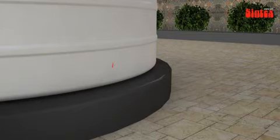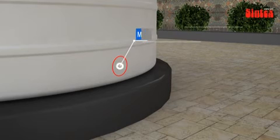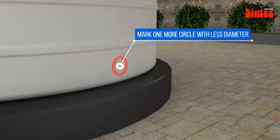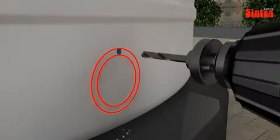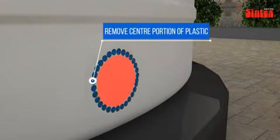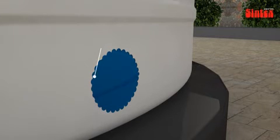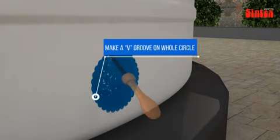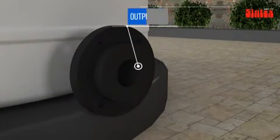For holes with 2 inches and more, determine the size of the hole to be made in the tank. Mark one more circle with a smaller diameter than the final hole diameter. Drill 5 to 6 mm holes between the intermediate space of the two circles. Remove the center portion of plastic to get the drilled hole, then remove redundant material in the circumference of the outer circle with a hand file.